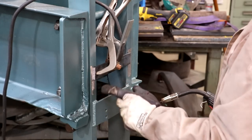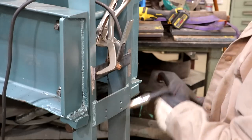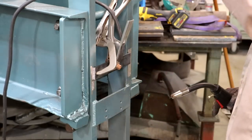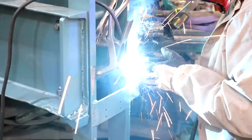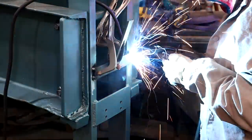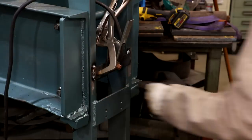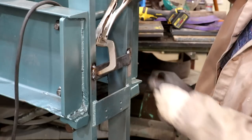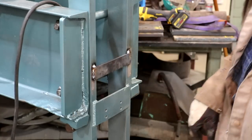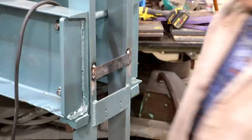I've got this little piece of metal clamped in here. Ground away a little bit of paint so I get a good clean weld. Got my ground hooked up on it. We're just going to use the MIG welder and put that in place — that's right where it needs to be. Just going to tack it on both sides first. All right, that should do it. Let me let that cool down. I'm going to repaint that real quick, and I'm going to grind those welds to make them look a little bit nicer. Not the greatest at welding straight up like that, but it'll hold.